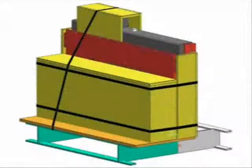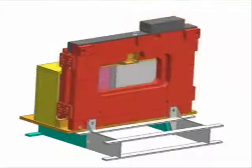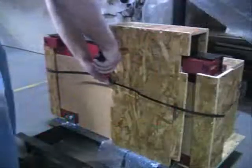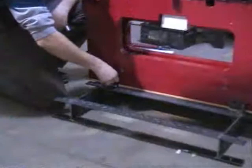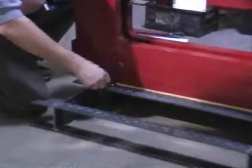The scale and indicator are shipped in an upright position for ease of installation, especially if only one person is installing the scale. Clip the metal bands encircling the scale and component box on the back side of the pallet, and remove the wood pieces protecting the sides of the scale. Remove the wooden cover containing the indicator, then loosen the bolts from the scale carriage assembly and remove the front portion of the steel pallet that the scale is sitting on.